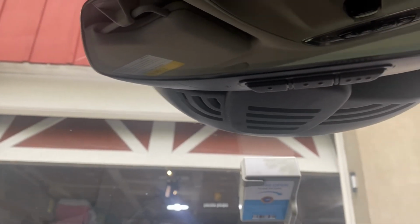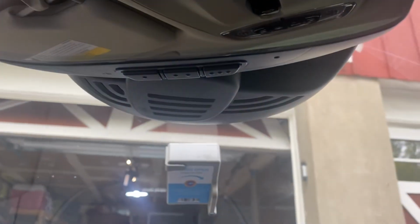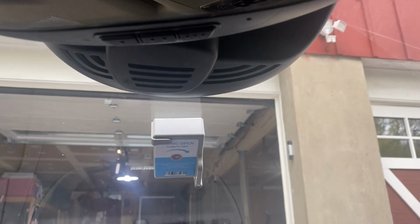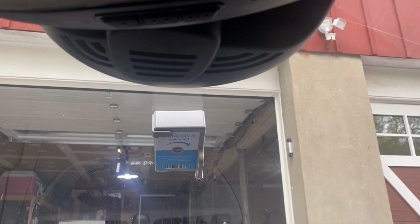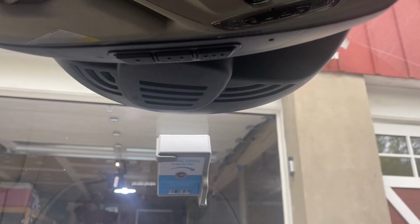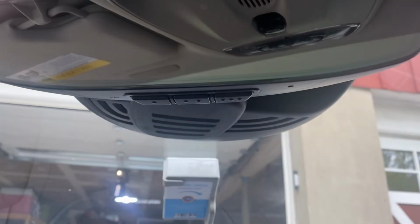And if you have an additional door to program, you don't have to go through the steps of doing 2 buttons and 3 buttons again. Just press the radio button on the second door, come back and press the second button, and the second or third time you press the second button, the door will run.